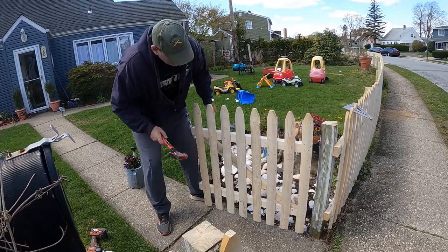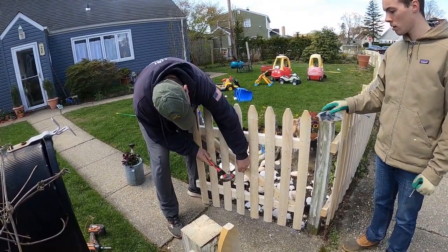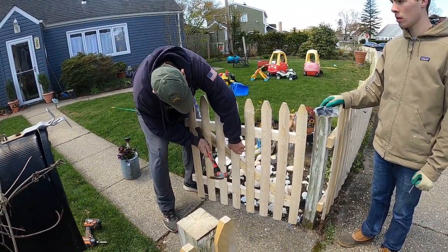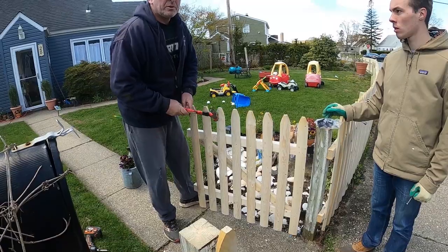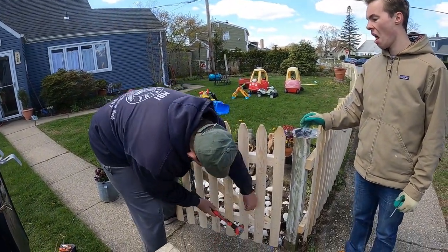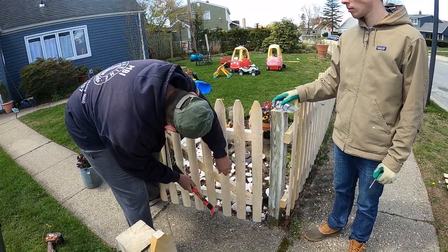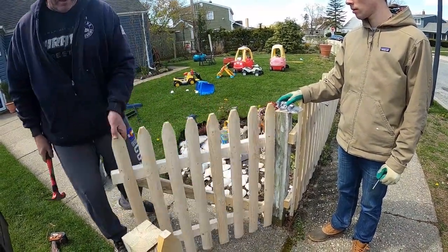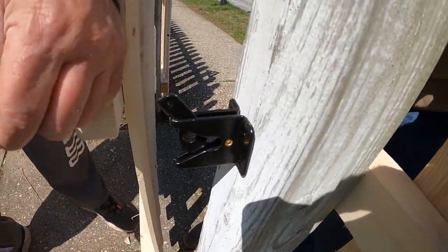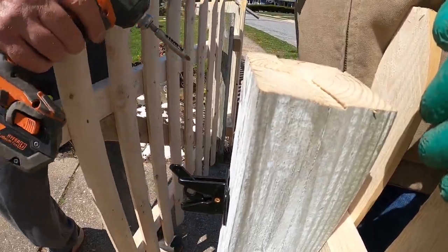You're just going to throw a couple of nails into the picket and in the brace — it'll keep the brace in line. If you just screw it into the top and the bottom rail it could always come loose, but this is just a little bit more support. Like we do in the shop with the gates, we always brace them. We're going to do the same here. Even though they're cheap little automatic latches, if it hits anywhere near there it's going to catch.